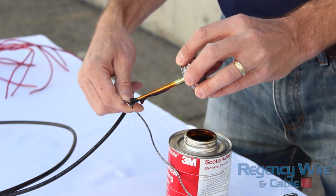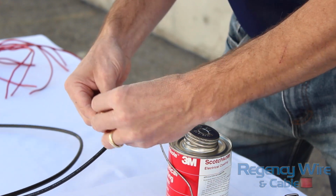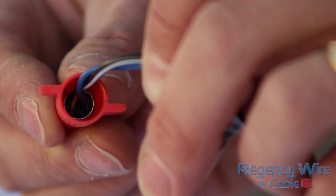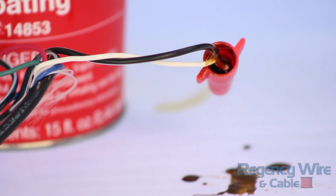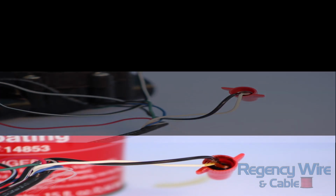Sometimes, inexperienced users will attempt to waterproof indoor splices with a coating or sealant. This is a risky practice, because not all pathways for moisture will always be sealed. Remember that whether splices are buried, placed in the humid environment of a valve box, or used above ground in the landscape, they will be exposed to moisture. Moisture inside the splice leads to corrosion, and corrosion will cause them to fail. Why take a chance on a critical yet inexpensive part?